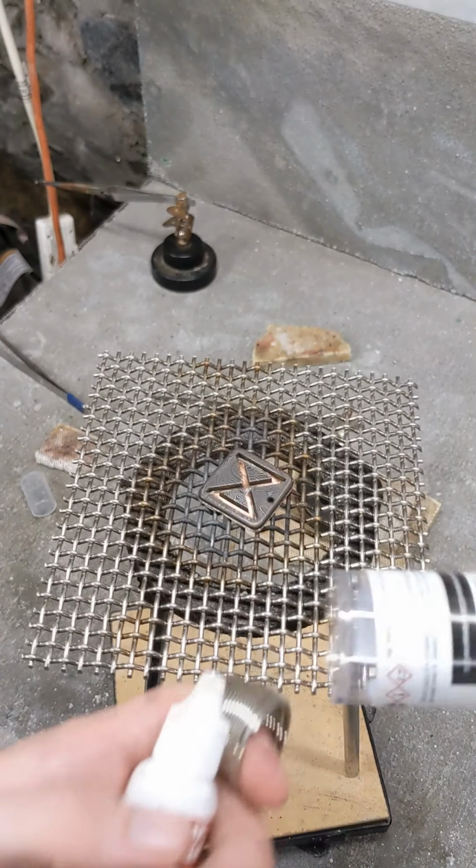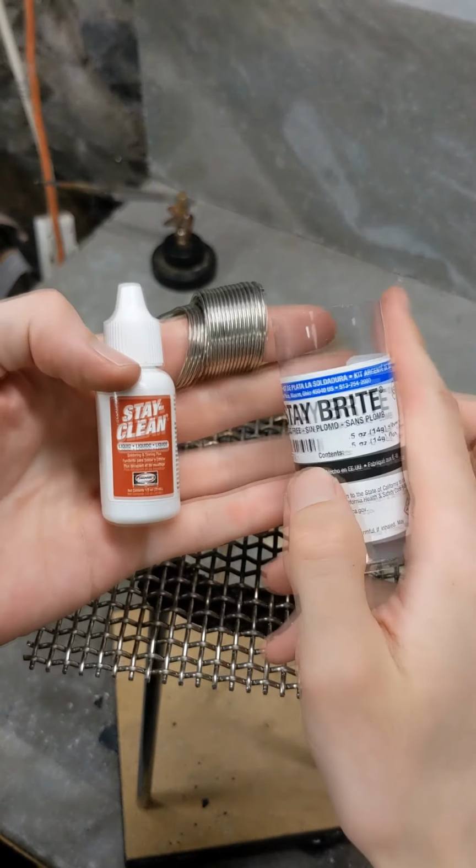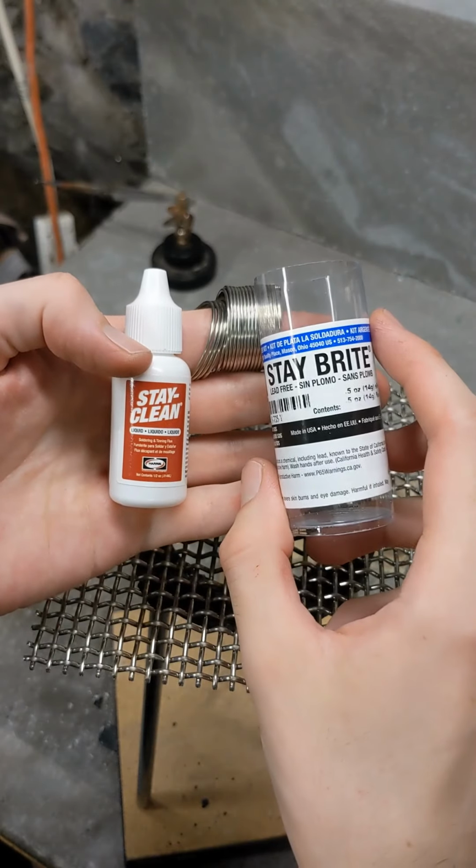Many years ago, a knife maker that I knew showed me the stuff that he used to join the guard to the blade of a knife that he was working on. It melts around 400 degrees Fahrenheit, so it won't ruin the temper. I used this stuff to stick the main body of the pendant to a sheet of copper.